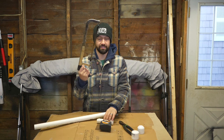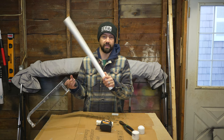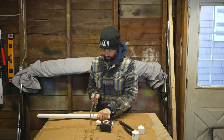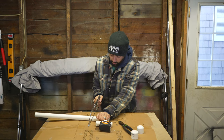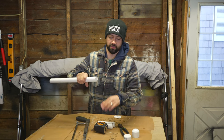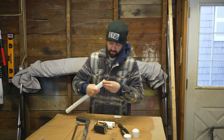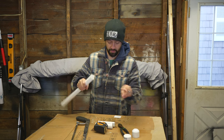I'm using a hacksaw with basically a metal blade. You can also use a piece of string to cut a piece of PVC, or any sort of blade that can cut through PVC. It's not pretty, but it works. Take all those little burrs off — if you have a razor blade or something like that, you can take all those extra pieces off.